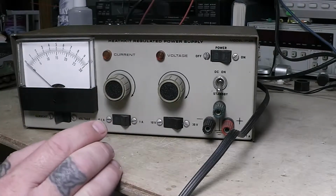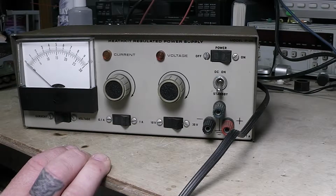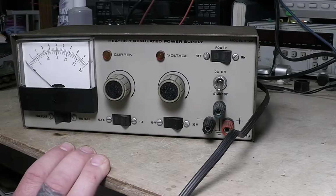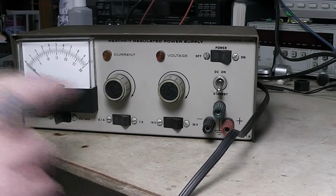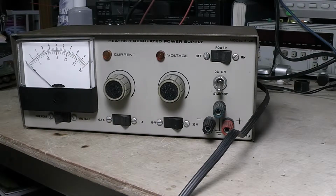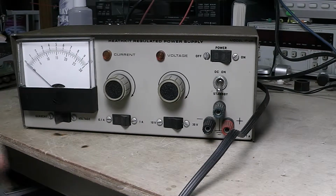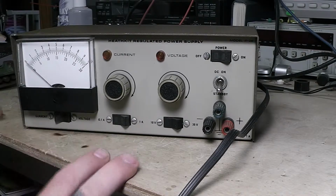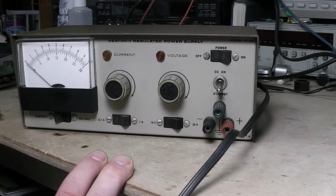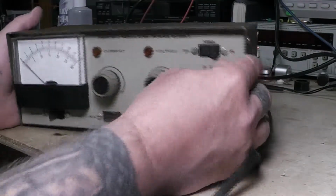Some of them are like the Teensy 3.5. It's a 3.3 volt, but it's tolerant to 5 volt or a little over. The 3.6 Teensy, though, is real strict on the 3.3 volts. Some of these TFT displays are really picky that I've come across. You go there, say 3.3 volts, and you get up to 3.5, you can zap those things. You'd think it'd be more like 3.8 or 4 volts before it starts stressing something out. But man, some of them are really picky. So if you're getting something like that, you can use the sensing on the back, hook it up, check it out. I guess I've bored you enough with that.